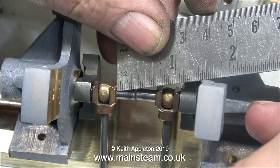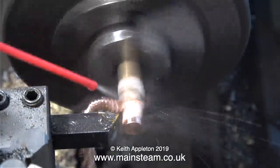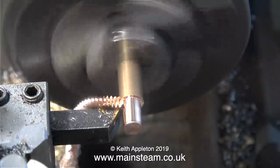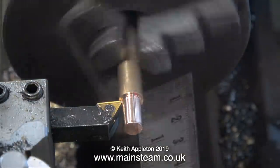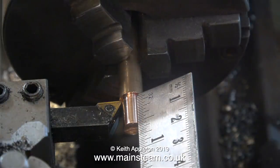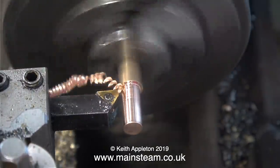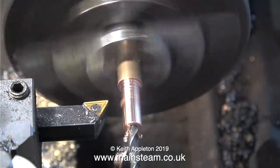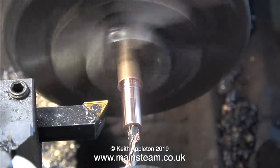The next part of the job is to machine a sleeve, and I'm using phosphor bronze — not the free-cutting type, but the normal old-style phosphor bronze that is not good to cut. It's okay provided you keep the temperature down, which is why I keep squirting WD-40 at it; it also acts as a temporary lubricant and it's cutting quite well. Now I'm centre drilling the bar, immediately followed by a twist drill which is one imperial size under 3-16ths of an inch.